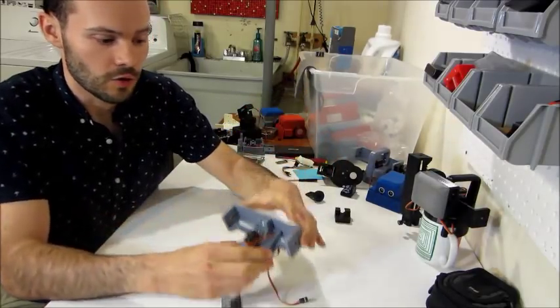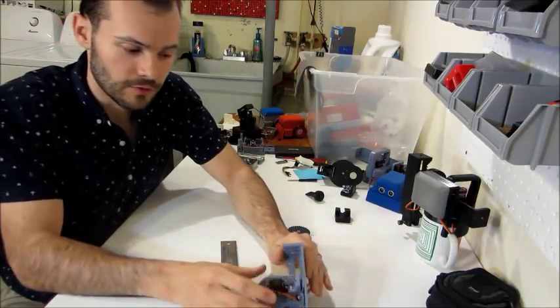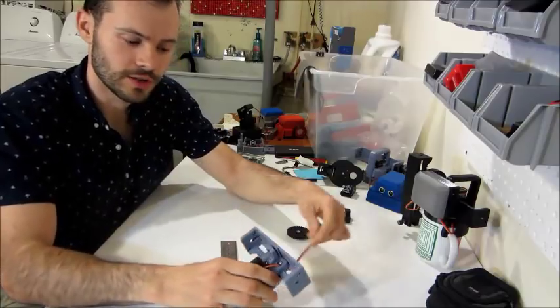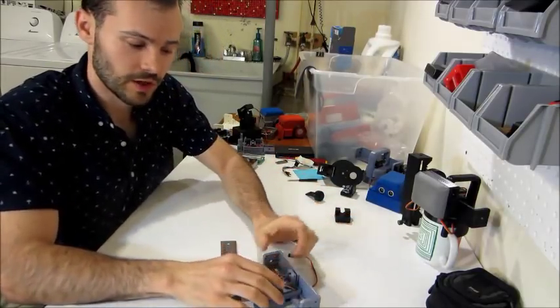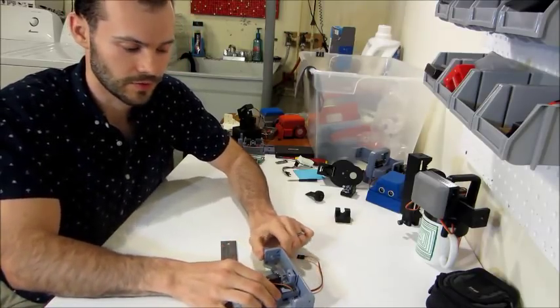Similarly, the rack itself will comply in this way around the pins that it rides on. And then finally, this sliced wedge here has a screw in the top — you can adjust the screw to whatever works for your specific setup to get the shake out, but not so much that it eats into the limited torque that these small servos can provide.